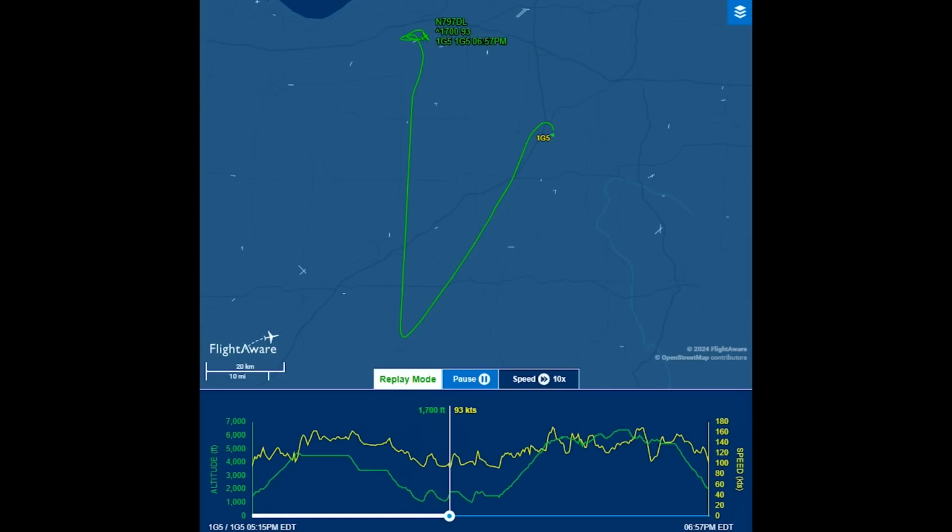The whole time I'm noticing that I am having significant cooling issues. I'm having trouble, and it's the new cylinders, not the old cylinders. The two cylinders that have the blast tubes are not doing too bad, but the other two cylinders, which have never had a problem before, are now hot. So I'm not quite sure what's going on there, but we'll look into that.